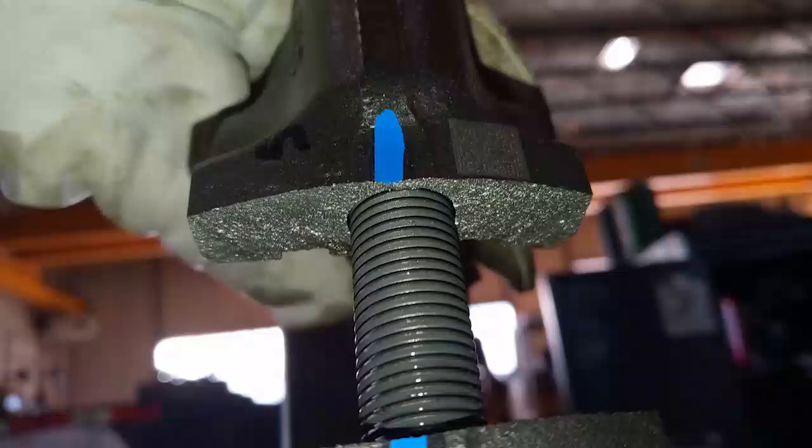So it sounds like all good things — why do they still make traditional machined rods? There are a couple of disadvantages with a fractured rod. One of them is for the mechanic. I hate fractured rods, and the reason is when handling them you have to be a lot more careful than with traditional rods. They're fractured, and where the fracture is, obviously it's not flat or smooth. There are all these little ridges, pits, and valleys, and they have to mate perfectly back together or they're going to become damaged. When installing pistons and rods into cylinders, putting bearings on, or cleaning these parts — if you were to drop them or hit them on something, you can chip those pieces away and they're not going to mate properly ever again. You've basically just ruined the rod, whereas with a traditional machined rod, a small mishap probably won't damage it.